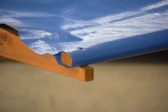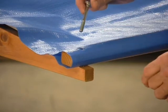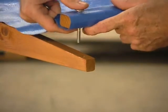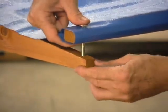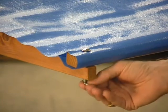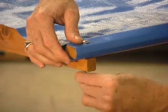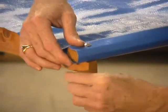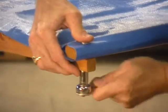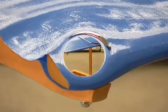After laying down the awning on the roof support frame, put your longest bolt, it's almost 2.5 inches, through the hole in the plastic, through the wood, through the hole in the bottom of the plastic, and then through the hole in the triangular support. Push it all the way down and put your washer onto the bolt, and then your cap nut. Turn those against it and tighten it up. Use your wrench. Great, and when you're done, you go all the way around to all 4 corners.